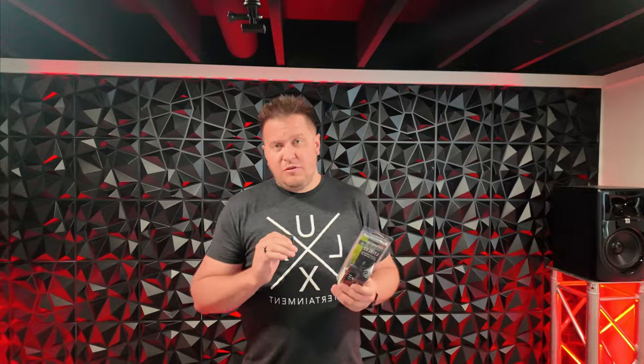I've also noticed that if I use this with my iPad, it actually increases the volume coming out — if I were to use a regular aux cable, it doesn't quite have the volume that this does coming out of my iPad. It also has the volume control and takes that stereo signal and turns it into mono. Another thing it does that I think is super cool is it protects your equipment. A lot of our external mixers use something called phantom power, and this will actually block the phantom power from going back into your computer or iPad and damaging it. I'll leave a link to this down in the description. If you're watching on Instagram or somewhere else, check out my bio — I've got a link to my Amazon store with a lot of cool stuff including this. It's just over 30 bucks, well worth the money, and it has a lot of applications. Definitely something cool to have in your toolbox.